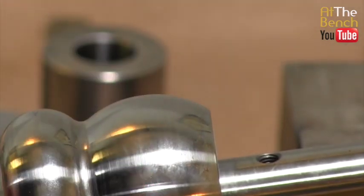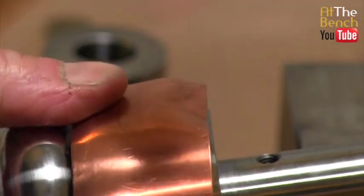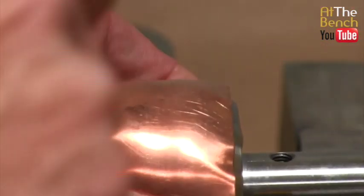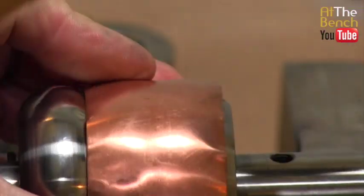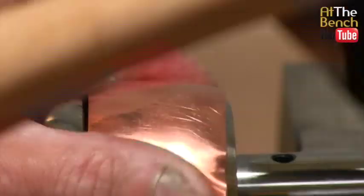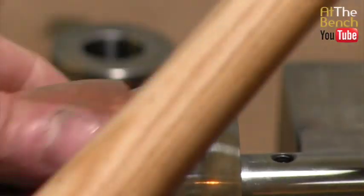And as you hammer along the one side here, you're hammering the curvature into the metal. If you want to turn it around, you can do. Onto this side here, and again, hammer. And I'm just rushing a little bit here. Getting a few little buckles on the outside edge here, but you can address that now if you want to with your Delrin hammer, just to go over that outer edge to get that nicely in contact, and likewise on this side.